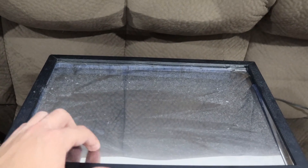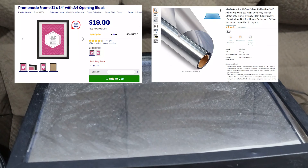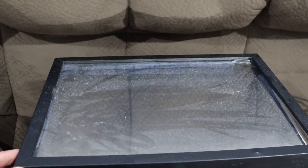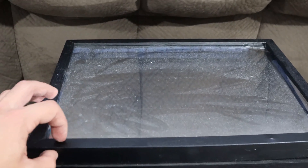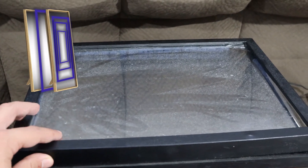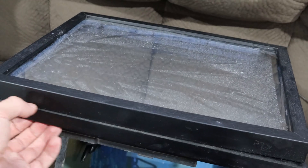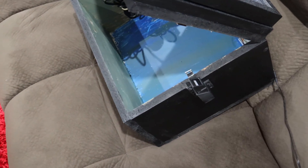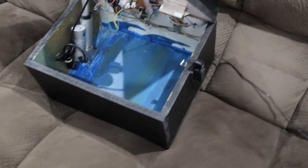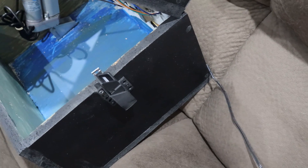For the outside: the top piece is clearly a mirror — I purchased a photo frame from my local office store and lined the glass with privacy film. I probably should have just bought a one-way mirror, as I had no patience getting all the air bubbles out, which affected the overall look. I had a second piece of privacy-film-lined acrylic on which I installed the LED strips between the two mirrors, screwed to a wooden backing and then onto the front panel of the box. Using a sheet of pine wood, I cut out five more rectangles, screwed all pieces together, then finished with a dark paint job and filled down all the screw holes for a unique look.